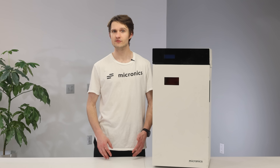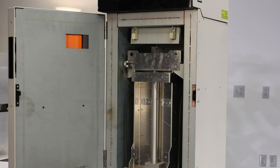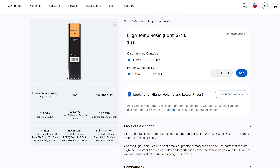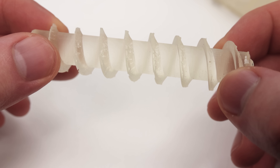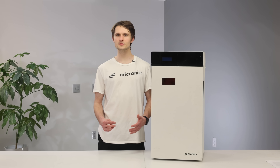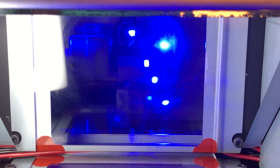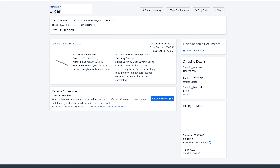In this version, we switched the powder handling system from a traditional gravity-fed system to one where the powder is stored under the build area and lifted using an auger. The entire printer is also heavily insulated to maintain a uniform printing temperature. One of the major challenges of building this prototype was making the auger. We initially tried 3D printing it out of high-temperature resin in multiple segments, but quickly realized that this would not be accurate or strong enough. So we bought a super cheap 4th axis and attached it to our CNC. However, due to the length of the auger, it could not be cut while only being supported by its ends. Therefore, we chose to make one out of PTFE. This of course wore down very quickly, but it lasted long enough to survive one print and produced our very first solid benchy. After this, we bit the bullet and paid Xometry $1500 for 10 augers for future prototypes.